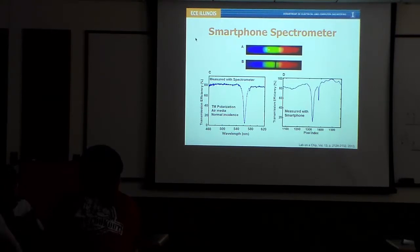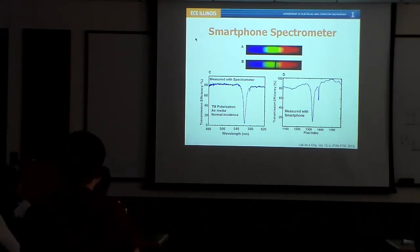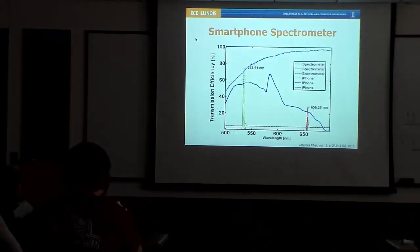Our first cradle was made out of machined aluminum and has about $200 worth of components. Instead of taking a picture of your friend or food, when your phone is in this cradle you get a spectrum. We see spreading of white light from the blue, green, and red parts of the spectrum. If we put our photonic crystal in that optical path, we see a dark band — these are the wavelengths resonant with the photonic crystal. We can simply calibrate the pixels to actual wavelength values by taking a red laser pointer and a green laser pointer and shining them into that pinhole.